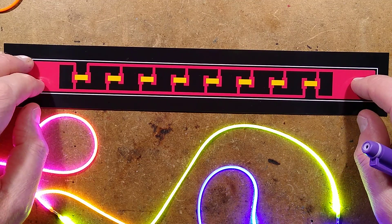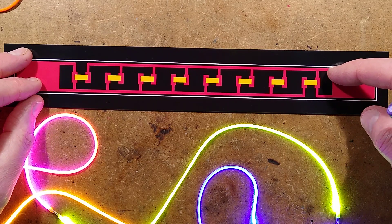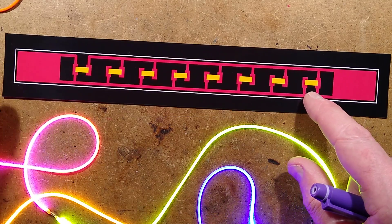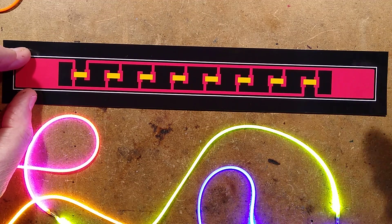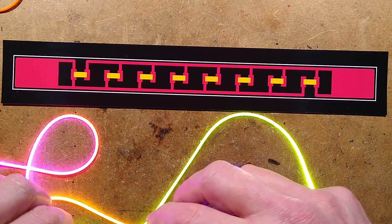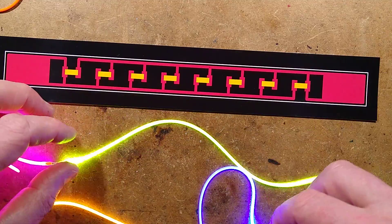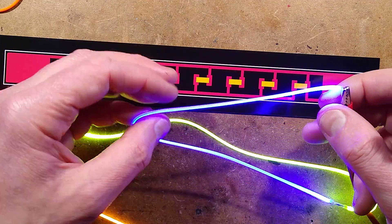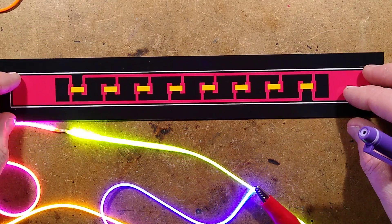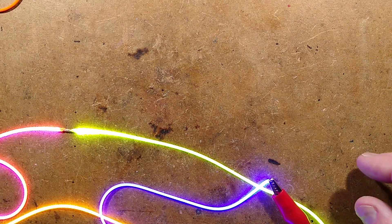The arrangement has a positive end and a negative end with a large pad, thermal isolation going to the first LED, then a bus up one side connecting to the positive of all the LEDs, and another bus down all the negatives. Theoretically, the LED at one end has the same circuit resistance as the LED in the middle because the tracks are the same length. But in reality the green is visibly brighter at both ends and duller in the middle, as is the blue. I'm not sure why the current isn't sharing equally — possibly degradation from the reflow process.